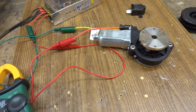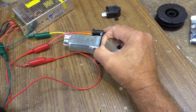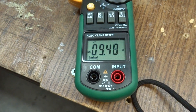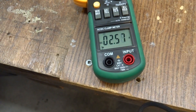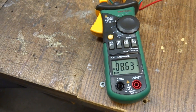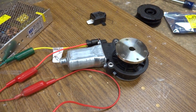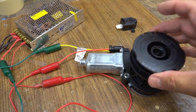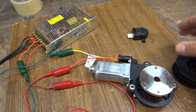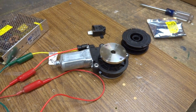It pulls about three amps when it's running like this. If I go to try to stall it, I can't hardly stop it — when I do that it'll come up to about 10 amps. Right now it's running about two and a half to three amps. I think it's going to be great — it'll be strong enough to pull that arm in and out. I just have to figure out how to get this pulley attached, get my encoder mounted, and hook up all my wiring for my Kangaroo and my Sabre Tooth. And I think we're going to be good to go. Thanks for watching, have a good one. Bye.